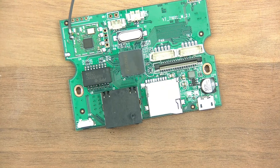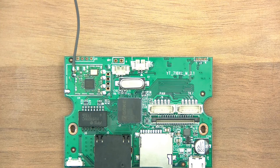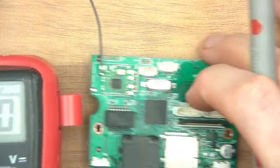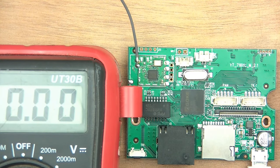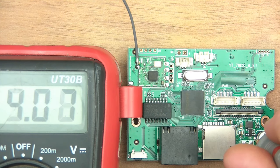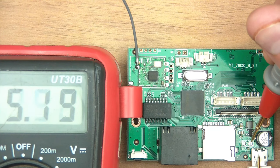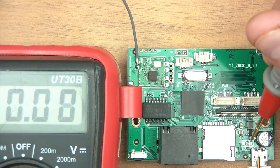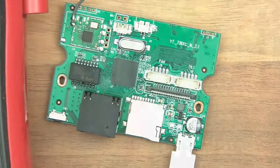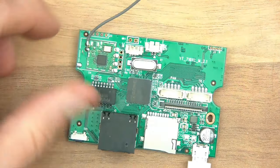Let's plug it back in. Now I need my multimeter. I need to find out where this 5-volt line goes. Hopefully you can see the multimeter there. The casing is ground. Let's see if we can find 5 volts — that's ground there, yes. Inside will be 5.19 volts. Somewhere around here will be 5.19 as well — yes, 5.14, 5.19. That's got quite a big contact — that'll be ground. There's nothing that really stands out other than where this diode is. I know where the solder point will need to be — just there.